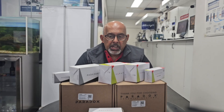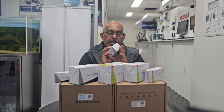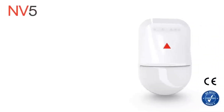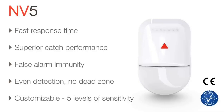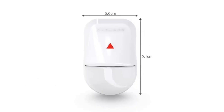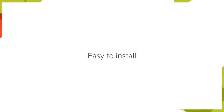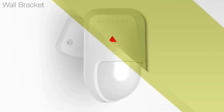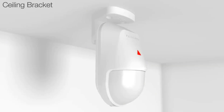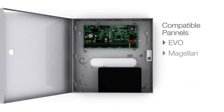We'll start with the most entry-level sensor, the NV5. Even though it's entry level, it has better performance than most other brands. It features auto pulse signal processing for better accuracy, better false alarm immunity, and pet resistance up to 16 kg. It also has digital sensitivity adjustments and support for super creep mirror for tighter areas. Key features: 10x10 meter coverage with a 90-degree angle, fully digital signal processing, equal beam patterns, and pet immunity up to 16 kg.